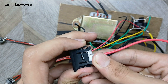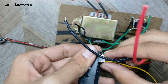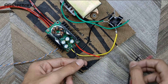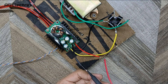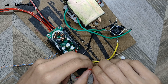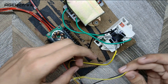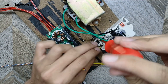I'll just remove the connectors to make soldering easy. Now I am connecting the black ammeter wire to the negative output of the buck converter and the yellow one to the positive output. Then I am connecting the positive and negative wires for the display to this 12 volt SMPS.